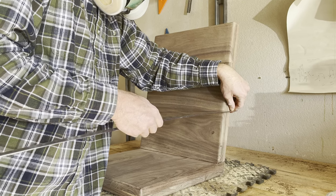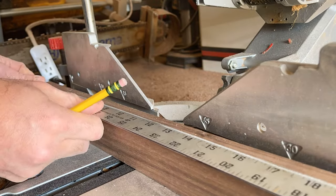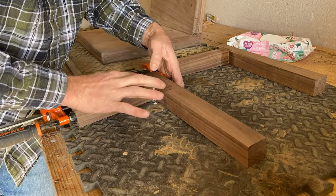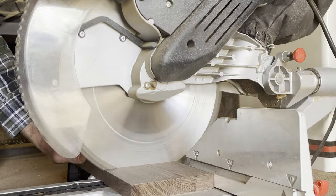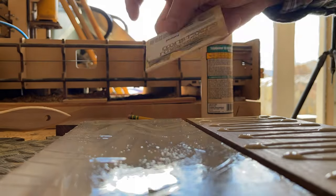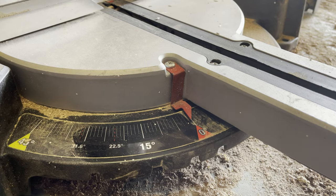The headrests and armrests were designed into the chair, and as time ran short I heavily debated skipping this portion of the project — but I just couldn't push it out on YouTube without them, even if it delayed the schedule a bit. An issue with the armrest was taking into consideration the extra foam padding I added to the seat, which cost me another inch or so — I was afraid of adding the armrest too low now that my son would be sitting a bit higher. I originally intended a more modern armrest design but had to settle for a simple right angle. For the headrest, since the chair was angled at 10 degrees, I decided to do the same with each lateral side, giving it that unique modern look. We glued two walnut boards together to give it that common thickness.